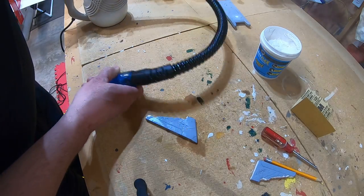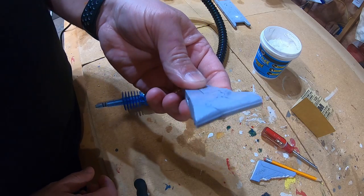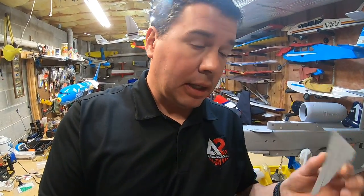I also found out that when it comes to removing water slide decals, this thing works really well too. Look at that — it's almost popped perfectly out of there. This is what the internet is all about, ideas like this. Now that the foam has popped, if you want to finish it off, use a little bit of spackle as shown in the first tip, then light sanding and painting. Go to Home Depot or Lowe's — they'll paint-match a sample for you. It's about three dollars to match the paint and they do a very good job.